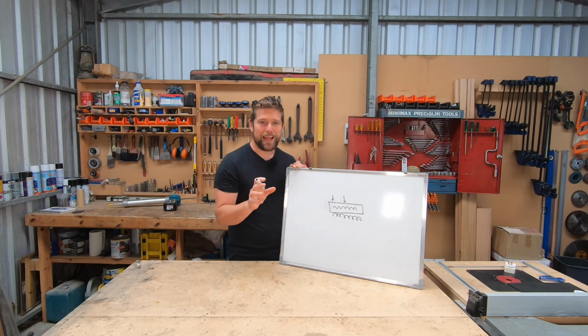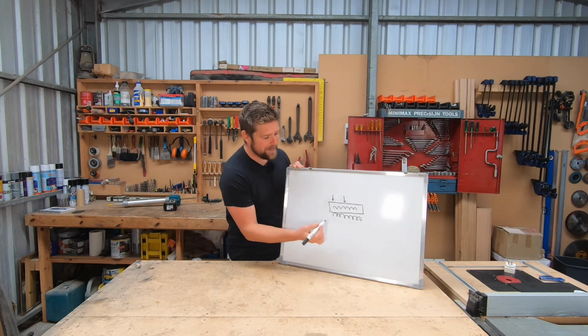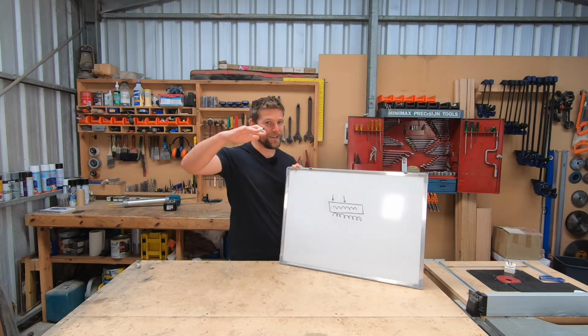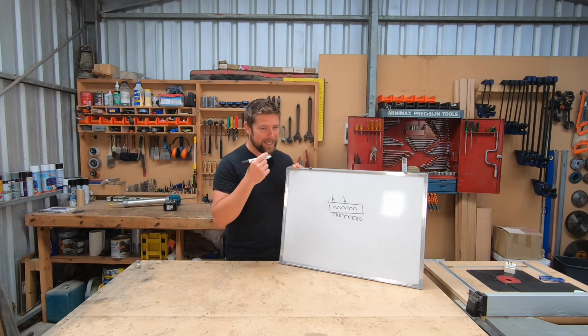Now, trick for young players, if you're making your own double glazed window, make sure there's no fingerprints or smears on the inside. I had the joy of getting the glass nice and clean, and as I was cleaning it, left a little smear on there, had a nice smear on that bottom piece of glass. And I was gonna leave it, but in the morning sun, it really showed up, so I had to take it out, remove the piece of glass, which is an absolute nightmare, clean it, and then put it all back in.